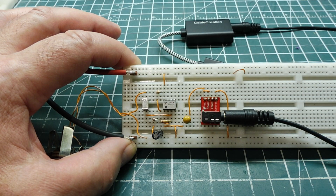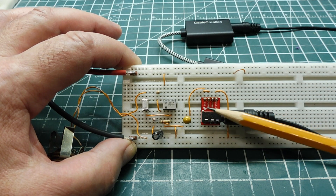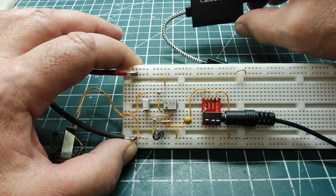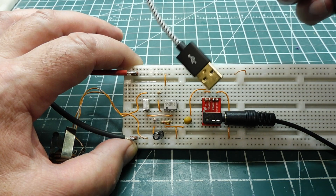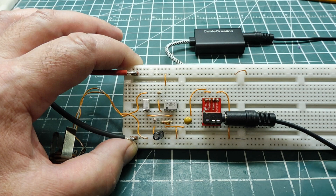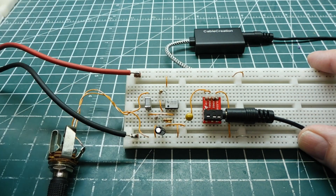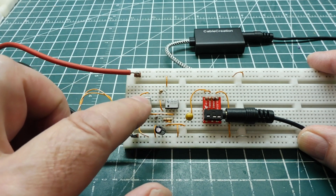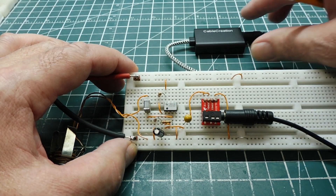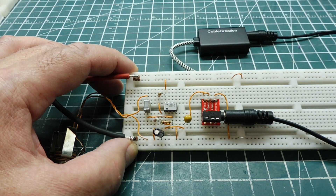To monitor the sound output of the buffer amplifier connected to the guitar, I have a breakout board for a 3.5mm jack plugged into a USB external sound card, which you can plug into your computer. You set your default sound settings to use this USB sound card, and you can monitor the sound coming out of the guitar. The guitar is plugged into the jack, which is plugged into my buffer amplifier, and the output of the 3.5mm jack connects to my USB external sound card going to my computer.